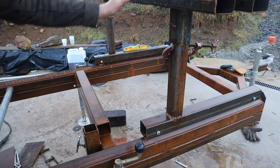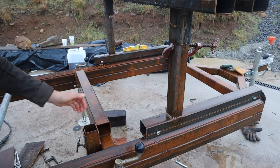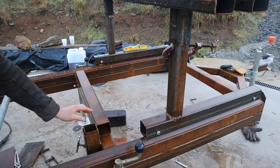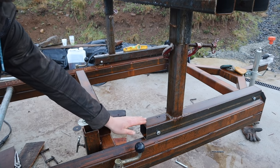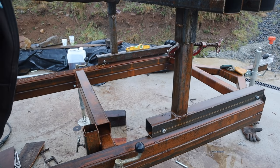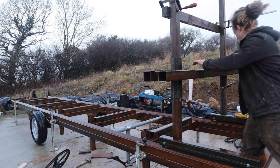So what I'm going to do is make some wooden slats, I think, to raise this up, because it seems to me a good idea to not have your nice beam sliding around on painted metal or rusty metal anyway. So I'll make some wooden slats, raise that up, and then that'll get me down so that the blade will be close to here but not touching. I'll probably angle these back a bit as well, and then we'll get a minimum cut. So I'm going to make those changes before we go any further. But yeah, I thought I'd just show you, it's all running lovely.